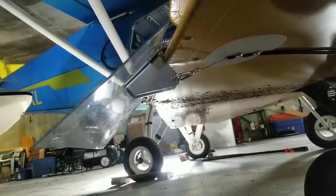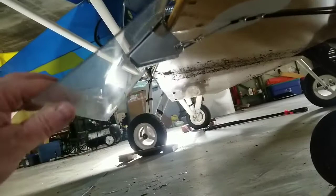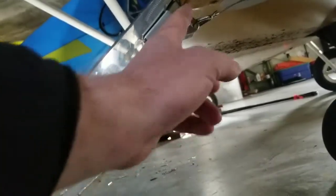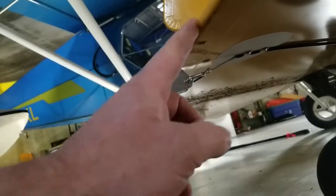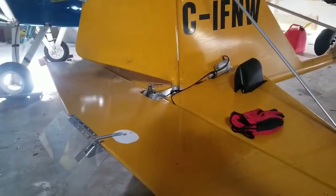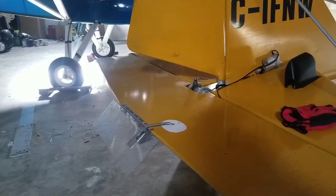The only little mistake I made was putting it this close — this is as far down as it'll go because of that. So I have it adjusted so that when the actuator is fully closed and pulled, it just stops just shy so it doesn't dent my elevator.